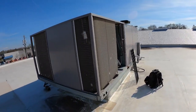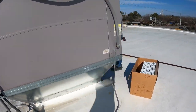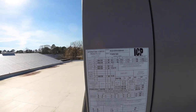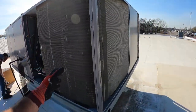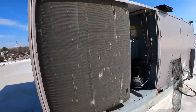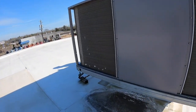This is the equipment. We've got a compressor on this side doing our filter changes, and this is a 20-ton package rooftop unit. One compressor does basically half of a coil on the condenser coil and the evap coil, and the other compressor does the other half. Sometimes they split it top and bottom, sometimes they split it half and half.